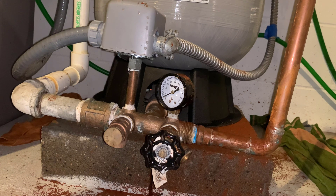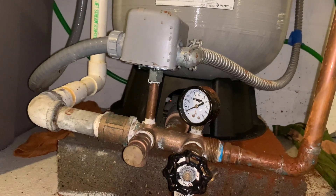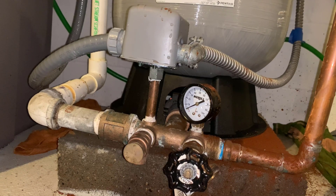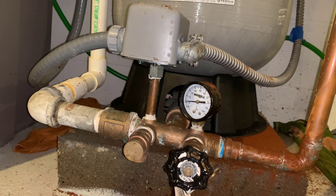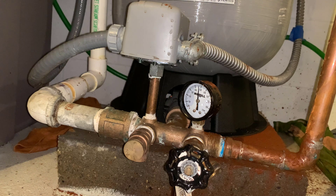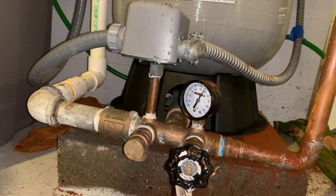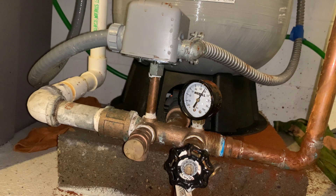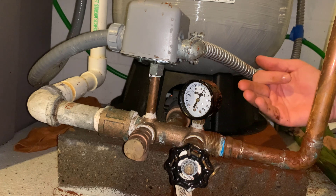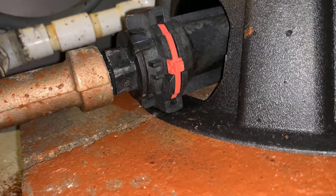We are all plumbed up. This is off and I still have my house connection closed, so I'm about to turn on the pump and see if this leaks or explodes or anything. That made a weird sound. Well, it went up to 50 psi right away, going to 60, and then it should turn off. Initial appearances are that things are working. I don't feel any water coming out of the connections here. That guy looks like it's sitting on the ground, which hopefully is okay, but I don't see any leaks.